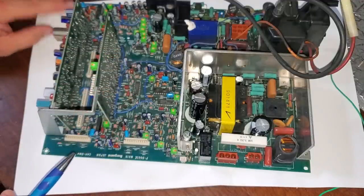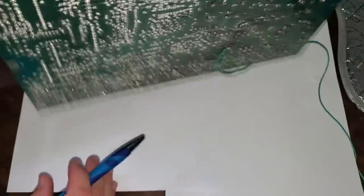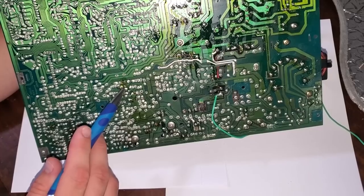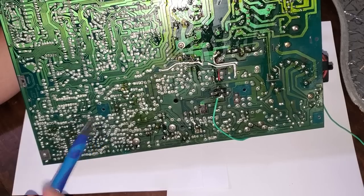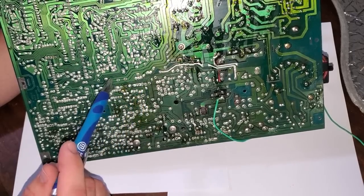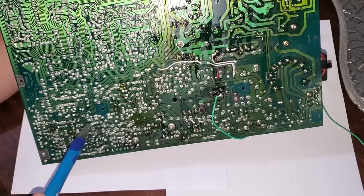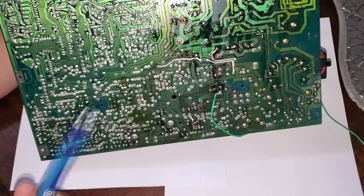A lot of these lifted resistors — they're all over the board and can easily bend and tap against each other with live metal, which would cause an issue. Another problem: this is a single-sided board, and no matter how careful I was, part of the pad would occasionally lift up. The good news with a single-sided board is it's very simple to run a trace. You can always test for continuity with a multimeter to make sure you're not having an open gap on any of these connections.